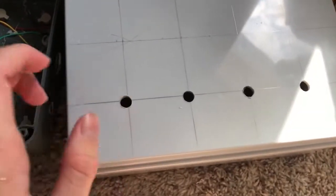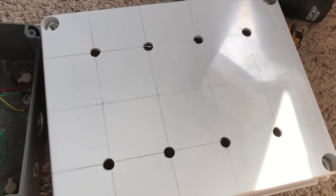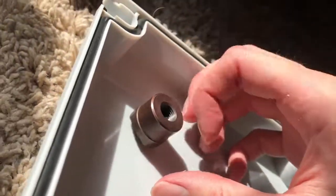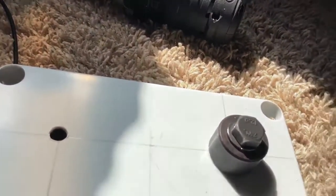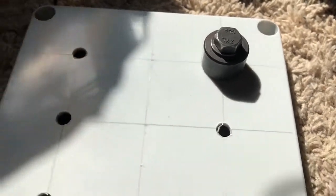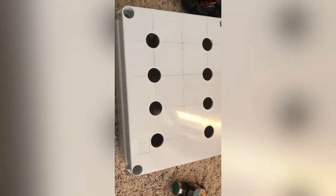The holes are drilled — 9mm. A few of them are a bit wonky, but honestly you're not going to really notice that too much. Way better than my other one. Now I'll demonstrate threading through the actual punch piece and how it works. I thread through the bolt and the main cap, the washer goes on top, and this little screw bit goes on the bottom. You screw that up nice and tight and you can see those teeth digging in down there. As you tighten this with a spanner, round and round the teeth lock, it pushes through and makes a perfect 22mm hole. I'm going to do that for all these holes.